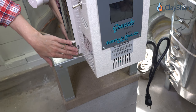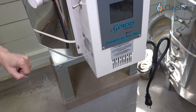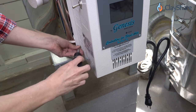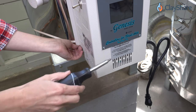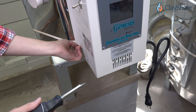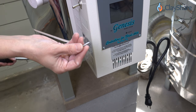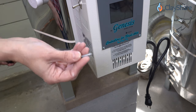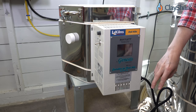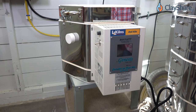We need to start by removing the kiln from the base, so you'll have to remove the control box. On this particular model, the little doll kiln, I have some screws holding a handle attached to the bottom — four screws total. I'm just going to use a Phillips screwdriver to remove them. Put the screws in a dish somewhere so you don't lose them. Your kiln might have more screws depending on the model.